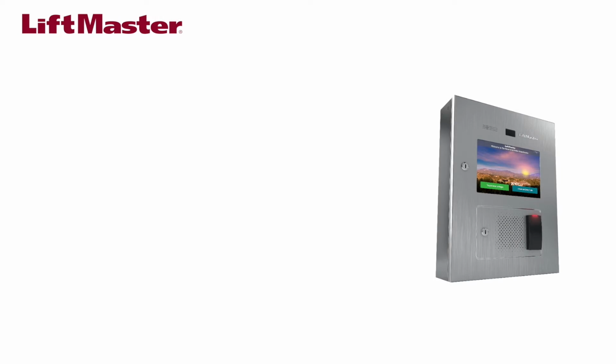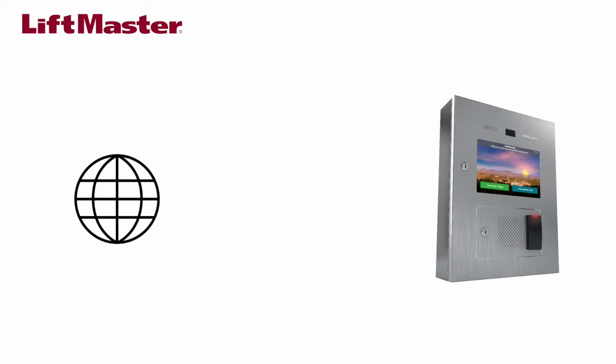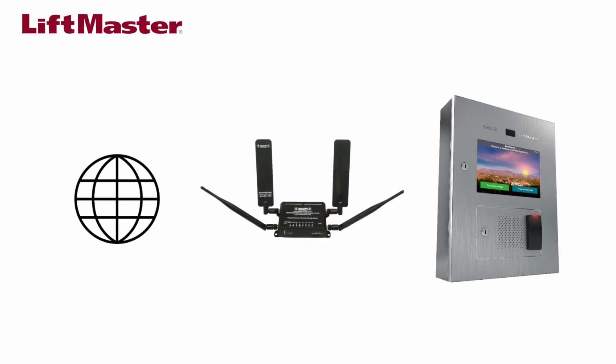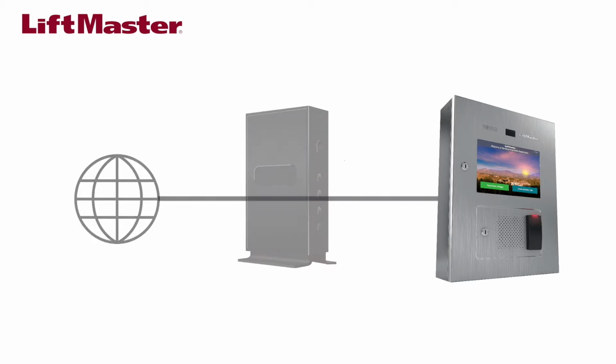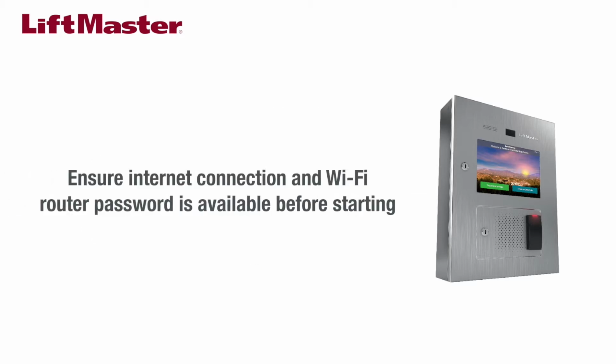The CAPXL can be connected to the internet in the following ways: Wi-Fi, cellular using the optional CAPXL module, and wired connection. Wired internet can either be a high-speed internet connection or the existing phone line can be upgraded to a DSL internet connection. Make sure the internet connection and any Wi-Fi router password is available prior to beginning the installation.